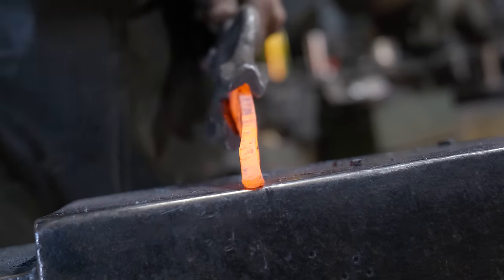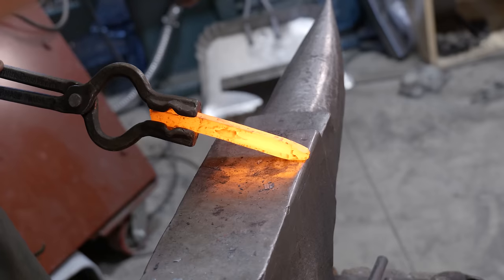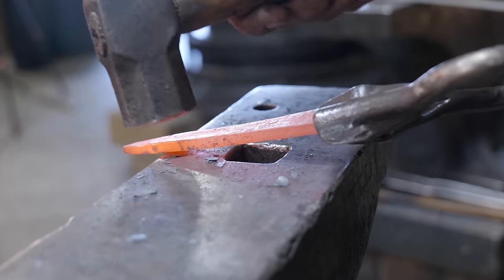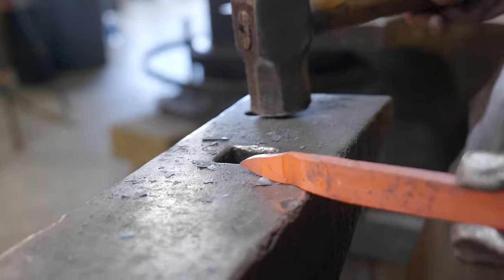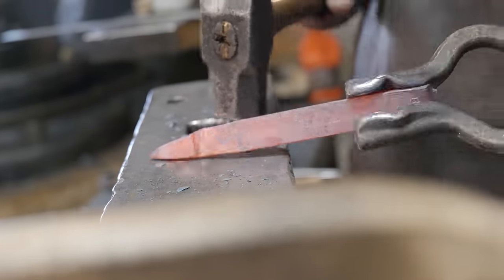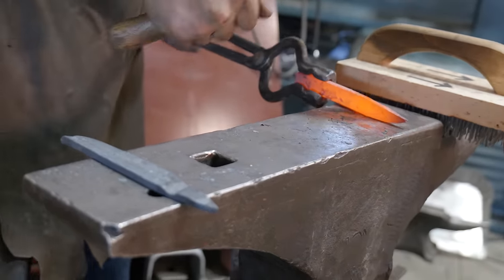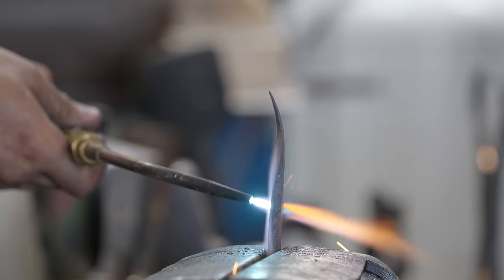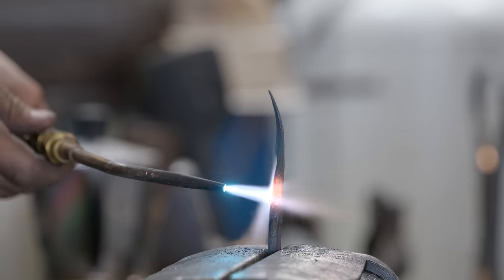Forging on the wrought iron, you have to do really hot, otherwise it wants to split apart on you. But I found that unfortunately, because I have to forge it so hot, it scaled up a ton, and the first set of handle pieces that I did actually got too thin just from forge scale. The forge scale that was building up, and then I would brush it off, ruined the handle pieces. So that is unfortunately part of the footage that got lost, but the first two handle pieces that I made just completely died from forging. Which was a huge bummer.